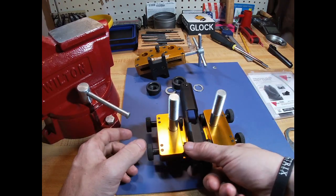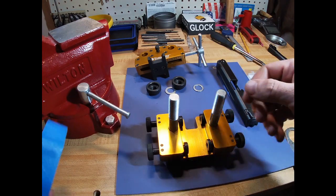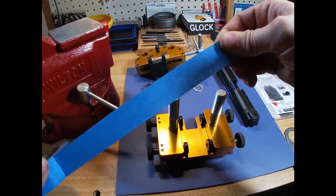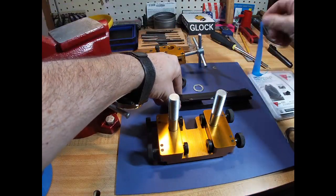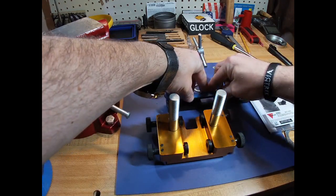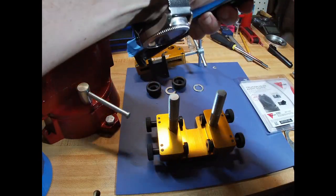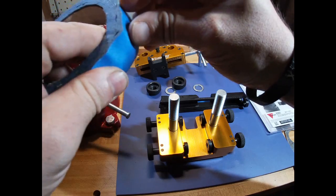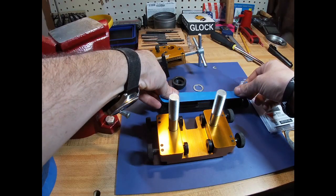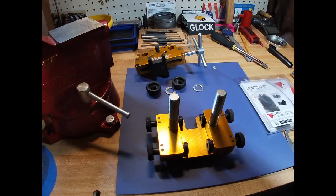So let's go ahead and remove the MMP sights. The first thing that I recommend is putting a little masking tape where you're going to be removing these sights. So I'm going to do front and back sights here. I'm just going to put a piece here. Not that it'll mar it up. I've done sights with this without doing them. Especially this is my gun, so I'm okay with it if it got a little dinged up, but if it was a customer's gun or something, then we'd want to take extra precaution and maybe even double tape here. So I do recommend putting masking tape there.